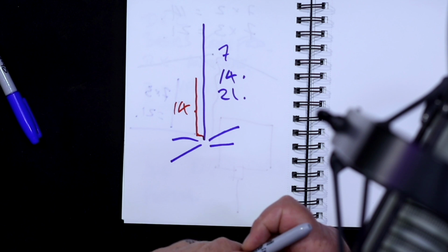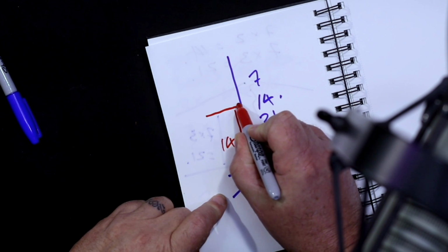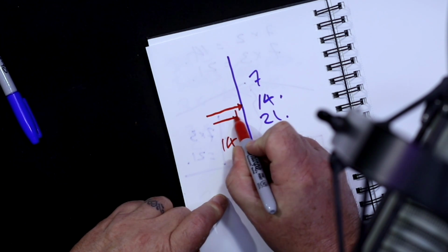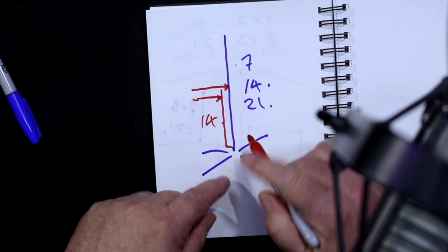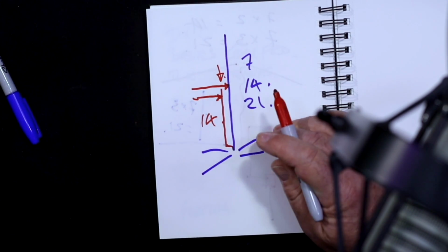And sure enough, a bit of trial and error, to be honest, because what I was discovering is that the spacing between there and there... Tyler's probably going, no, there's a way you can draw that, right? But that spacing was fairly critical. If I move the spacing around, it will change where the resonant frequency is. So it was quite critical to keep that in the same place.